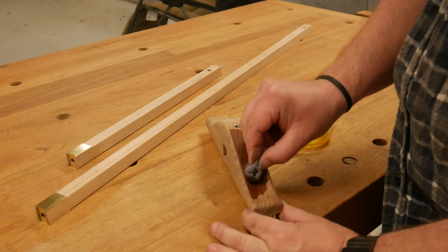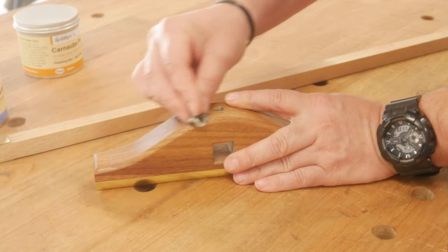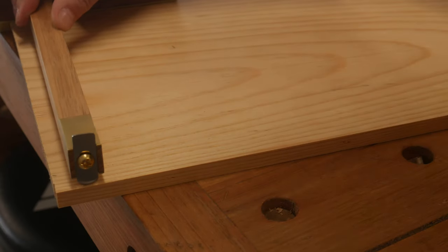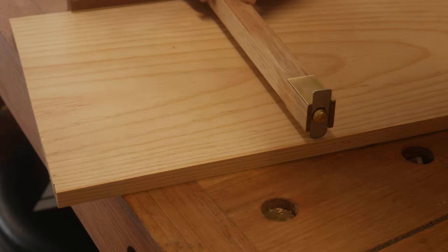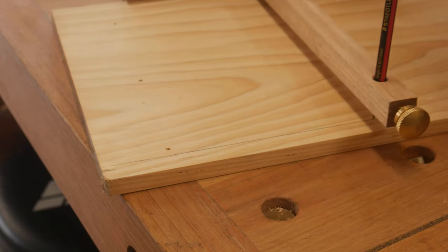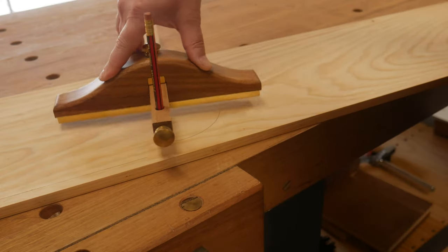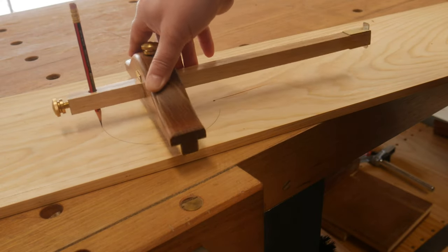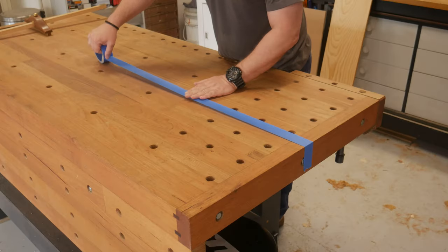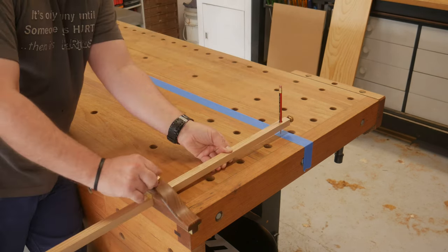I coat a finish and a polish, some assembly, and time for a test run. The gauge gets to be used in the traditional way, and now I can cut a baseline parallel to the opposite edge. Or whack a pencil in for a darker line to suit my old eyes. Now I had the option of inserting the pin and a circle can be marked out. To lay out an arch, a strip of masking tape is placed down the centre of the bench, and with the panel gauge a centre line is drawn.